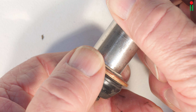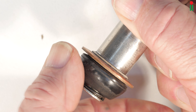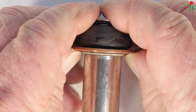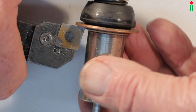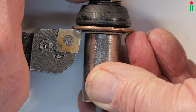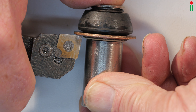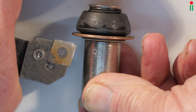However, the electrical contact — the copper washer — is spring loaded so that it is able to rotate and move axially. The effect of the spring manifests itself when you are actually trying to machine it with a cutting tool. The force of the cutting tool can actually stop rotation of the copper washer and make it slide axially.